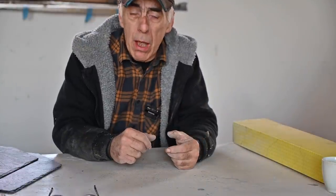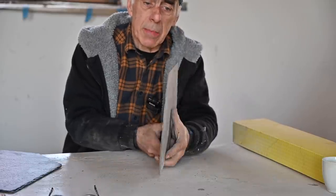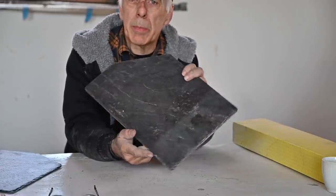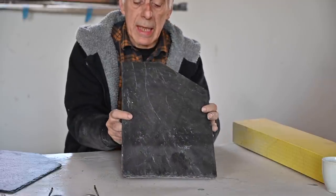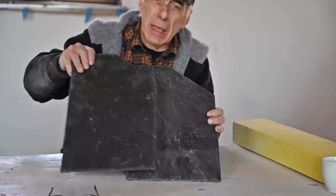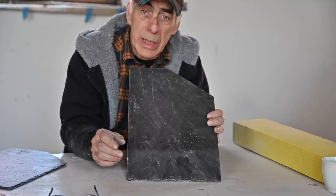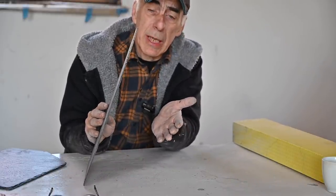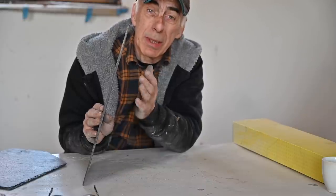The roof of the tower is covered with natural slates. Here I have one of those slates — this is natural stone, they slice them out of rock, they are very thin, very solid, and they last a lifetime and more. You find these on old churches quite often. Nowadays people use artificial slate but I went for original slates — quite expensive but worthwhile. Now these slates have quite some overlap when laying on the roof, but it is still possible to get some powder snow through the small gaps under heavy wind.